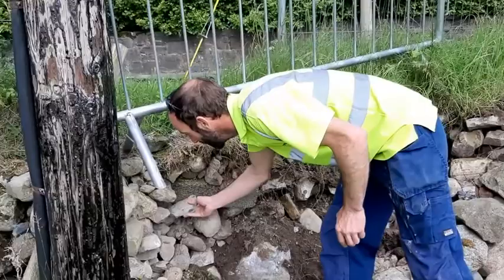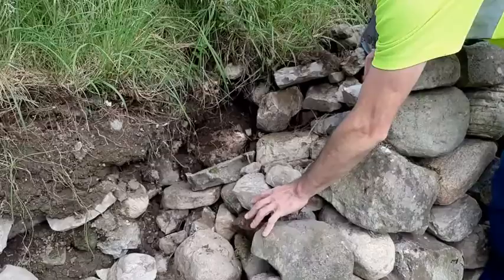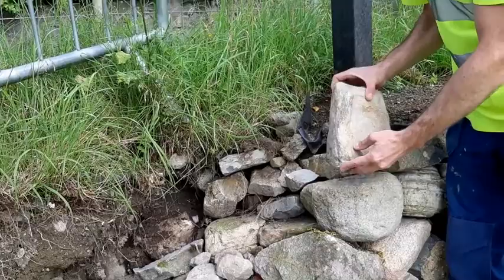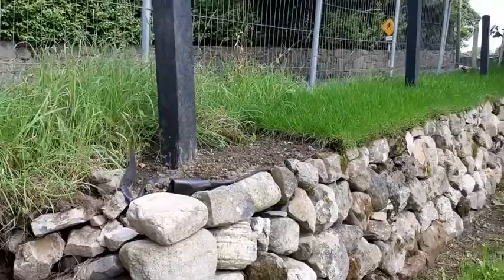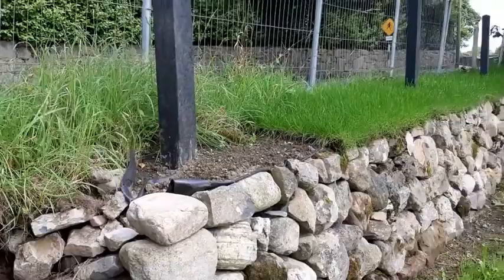So that's the loose wall in here — it needs to be placed in and laid. The wood here is all laid nice and solid. You build all your stones in, laid on their bed — it's not face bed; for example, that would be face bed, which is a no-no. And then we will place the sod on top, put it around underneath, to stop moisture getting in and out.